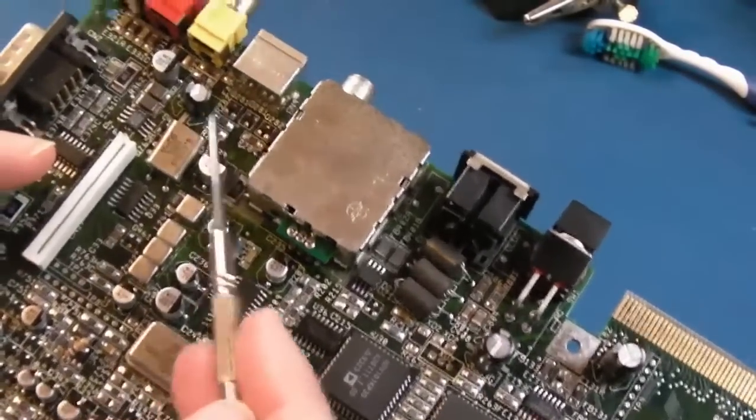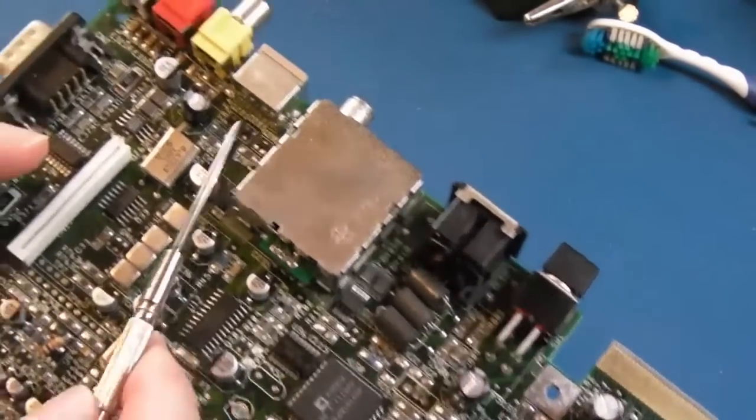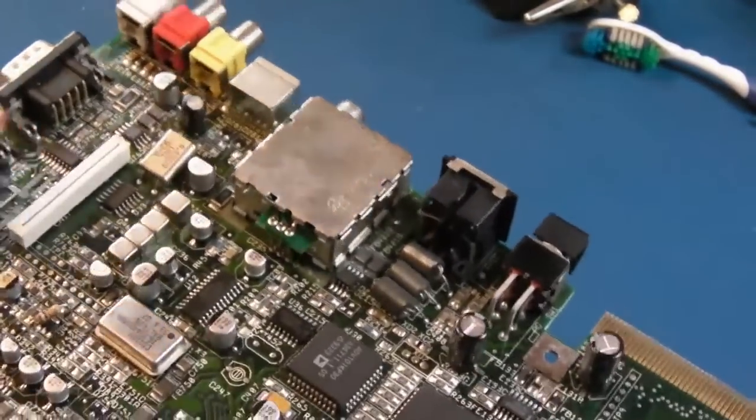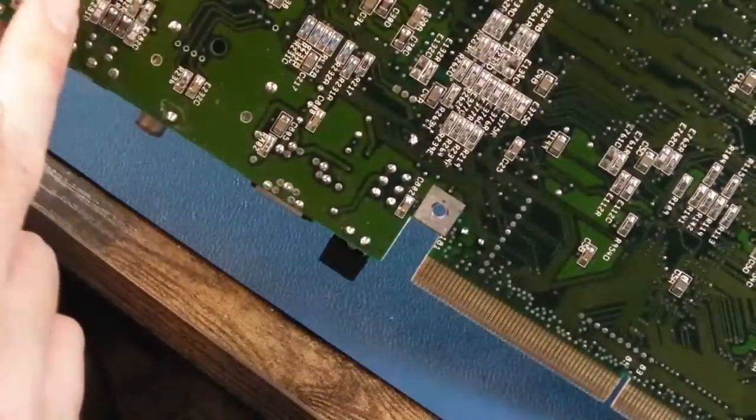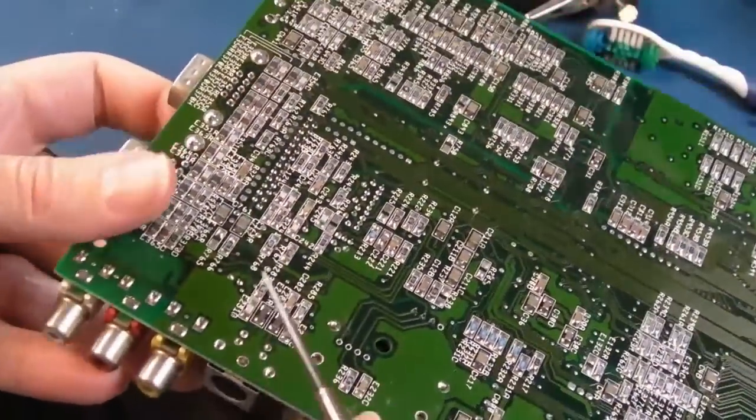It's the same with these actually. I mean, those you generally swap because they're usually the wrong way around and they'll have leaked. But like that one there, you could just leave it. But yeah, I am gonna swap it whilst I'm here if I can work out where the solder points are. I think it's these 2 here actually.